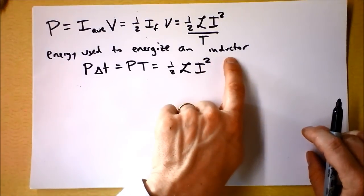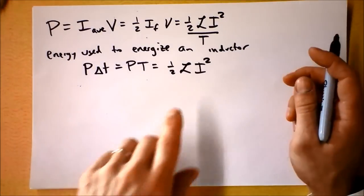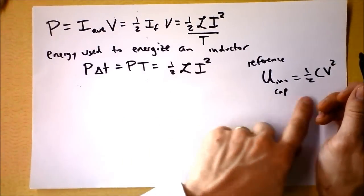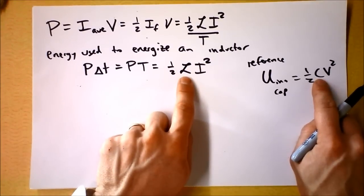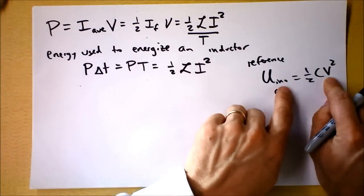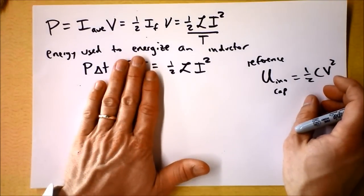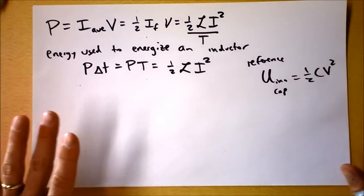If we had to use that much energy to get a current going through an inductor — pushing against its inertia — then that's the energy stored in the inductor. Compare this to the energy stored in a capacitor: ½CV². You've got the factor of a half, the value of the component (L or C), and you've got current for the inductor and voltage for the capacitor. There's a beautiful symmetry — these are analogs of each other: one stores static electrical energy, the other static magnetic energy.